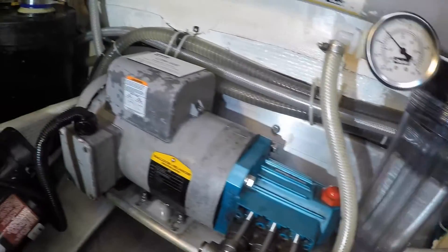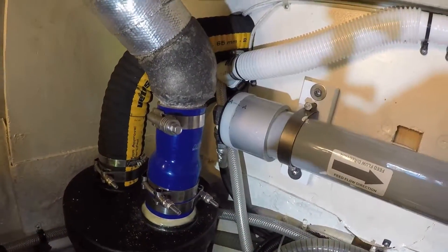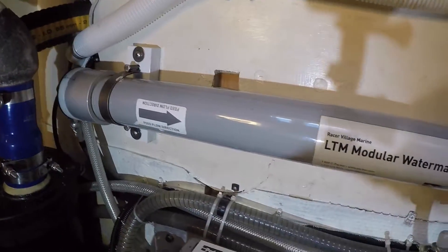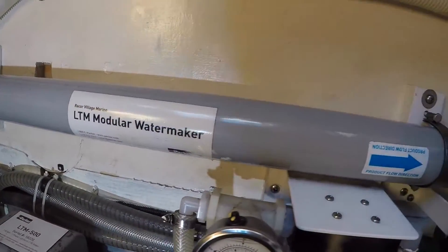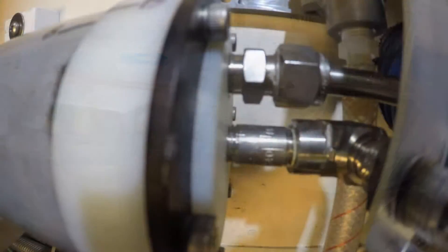Now the black high pressure hose loops up to enter the pressure vessel and membrane rack. Fresh water gets separated in the membrane, and at the other end of the pressure vessel you'll notice two pipes. It's important to notice what goes on here because it starts to get complicated if you don't differentiate the two. The bottom pipe only passes fresh water — there'll be some salinity during startup, but this will pass in a minute or two.